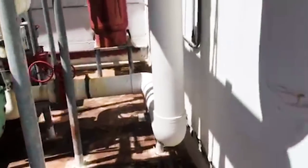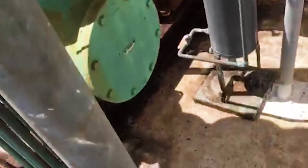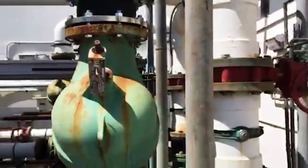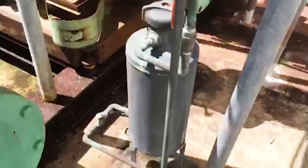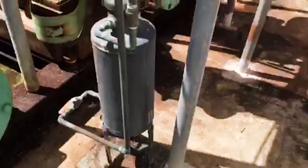This is our heat exchanger — we'll walk around for a better look. These are the closed loop pumps. This is some water chemical treatment piping feeding chemicals into our system. On the suction side there's going to be a strainer in each one of those. This piping is going to a differential pressure sensor right there, which is giving a signal to a drive to decide what speed to operate this pump. This is a chemical pot feeder, so you can feed the chemicals in using the pressure difference, and you can drain it at the bottom valve.